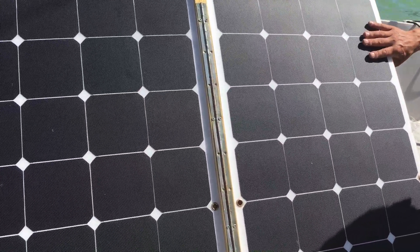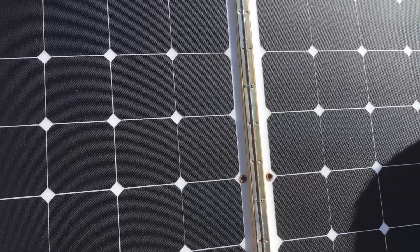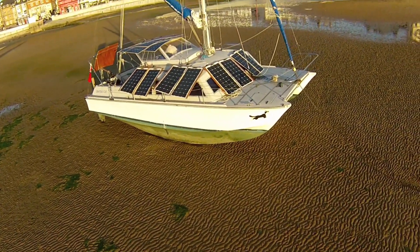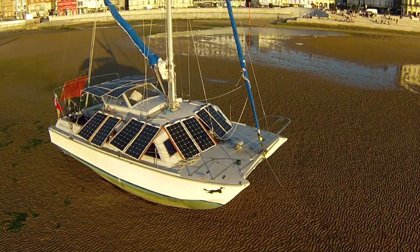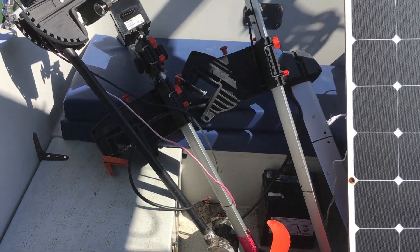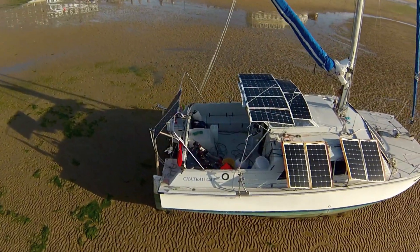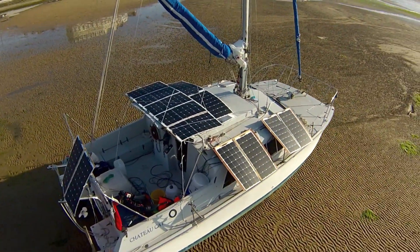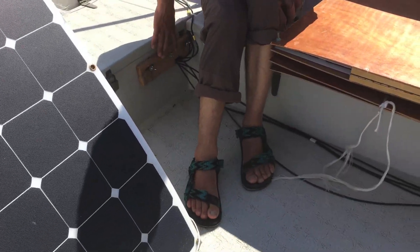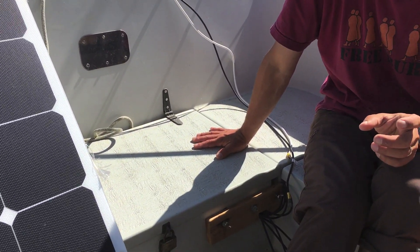The second thing is the solar panels. These solar panels were pretty much indestructible, great in terms of power and how well they held up. I had 15 solar panels arranged around the boat, and that was enough to keep the motors going at the power I wanted during a sunny day, and easily enough to keep the batteries topped up when I wasn't using the motors. Two key things: where to situate them — still working on that — and how to wire them into the batteries. We've got this junction box here, which worked well, but we are wiring 12-volt panels into a 24-volt system, which was a little bit difficult.